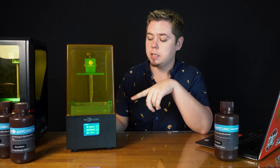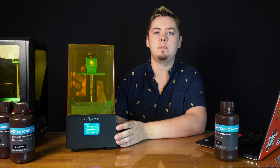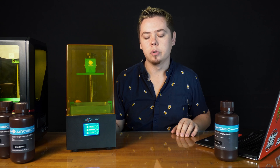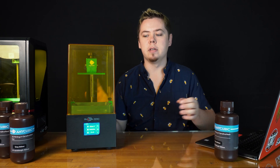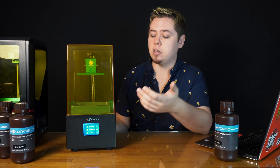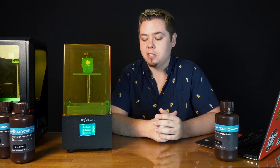There are a lot of good things about this machine, as well as a few I don't like — mainly the build plate pooling issue, the way the screen is taped down, and one other thing: there's no fan inside the lid. As this thing is printing, fumes are just building up inside, and the second you crack the lid open they all rush out and stink up your room. Just open it outside or in a well-ventilated area. But overall, it's a fantastic machine. You can't beat it for $170-$180 — it has all the features of the Photon and Photon S in a smaller, well-built package. Anyway, that's my review, I hope you enjoyed it — thanks for watching!